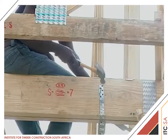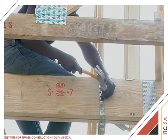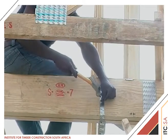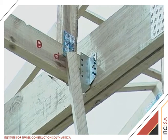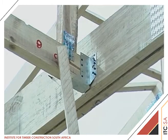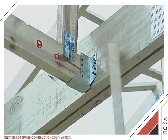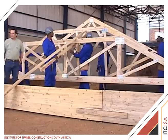The fixing of the anti-torsion strap on site shows the nailing of the strap under the truss bottom cord and up the side of the girder with the required number of nails, after the truss has been firmly pulled into the hanger. This is the method shown on page 12 of volume 2 of the handbook. The 90-degree hanger is fixed flush to the underside of the girder bottom cord after the girder has been hoisted into position.